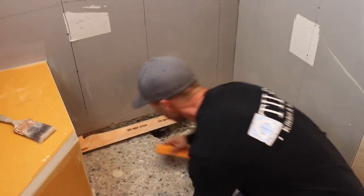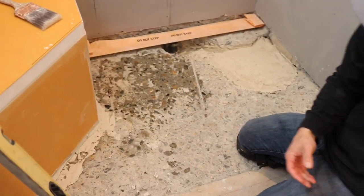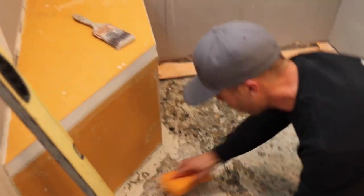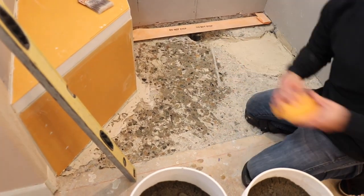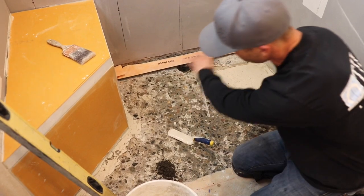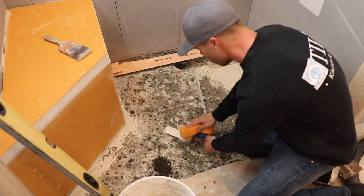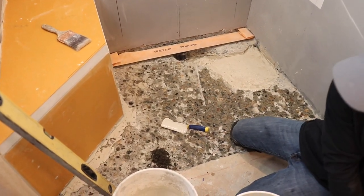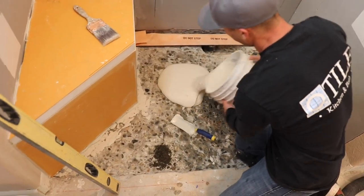It's really important to get your slab ready to adhere the deck mud when it's this thin. I want my dry pack or my deck mud to be adhered to this concrete. Just surface wet like this and just sprinkle dry cement, or you can use pure Portland cement mixed real loose. That's what they used to use back in the day, but we always have thinset and it works really good.